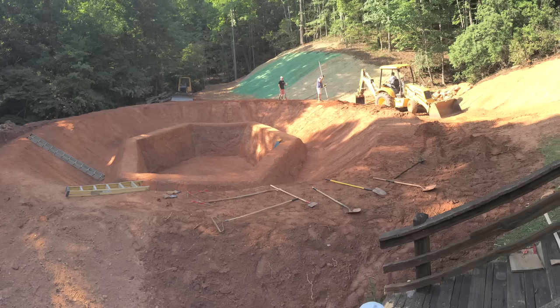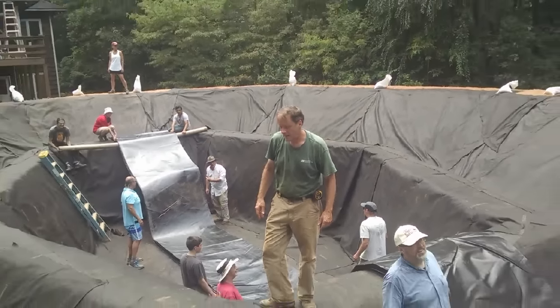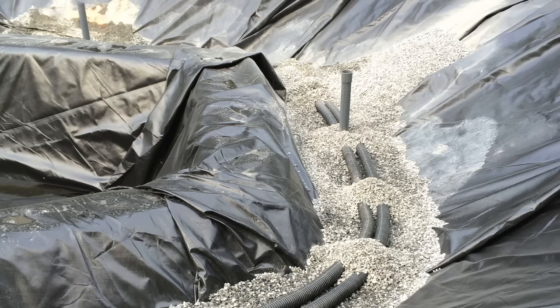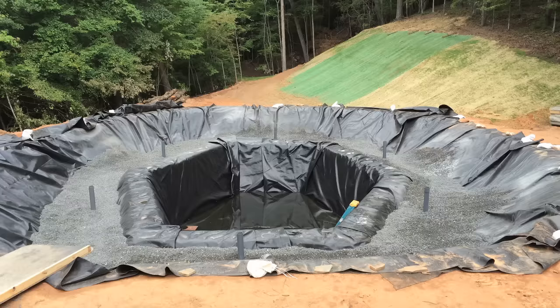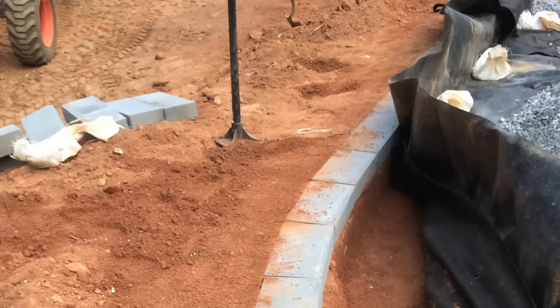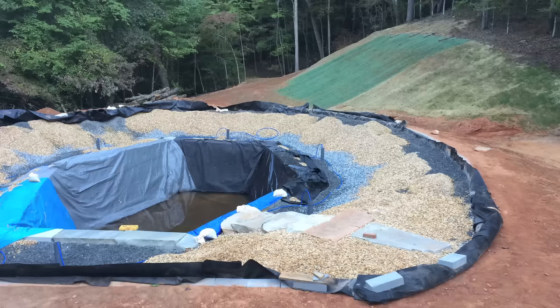Covering the earth with pond lining material is not a job to tackle on your own, so Alan asked friends along. He's such a popular guy he had manpower in abundance — 25 friends helped pull the liner into place. A black fleece underliner is laid first over the ground, ready for the water-impermeable liner to be laid over. This is a single sheet of RPE 40 reinforced polyethylene, around one millimetre thick. The plant filter pipework is laid around the ring trench with six airlift pipes vertically extending from this pipework, and the trench is filled with a coarse gravel of expanded shale. The pool edging is made resilient with concrete blocks so the pool lining edge can be trapped neatly against this with the weight of gravel. The stones at the top of the hexagon have been mortared in position and covered with tarpaulin while it sets.